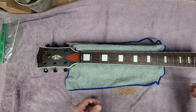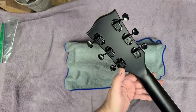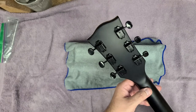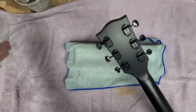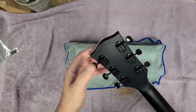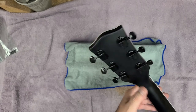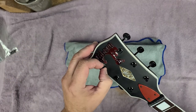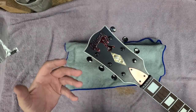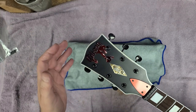It's complete — he wanted flat black, he got flat black, and it's flat black all over. I ended up filling in all the holes where the tuners are, so it doesn't look like swiss cheese anymore. I even got the right screws for the tuners — I've got a bag of screws to give him since he just had mismatched ones. The sleeves around the tuning posts have been filled with oak dowel rod and re-drilled, so now they are tight and won't come loose.